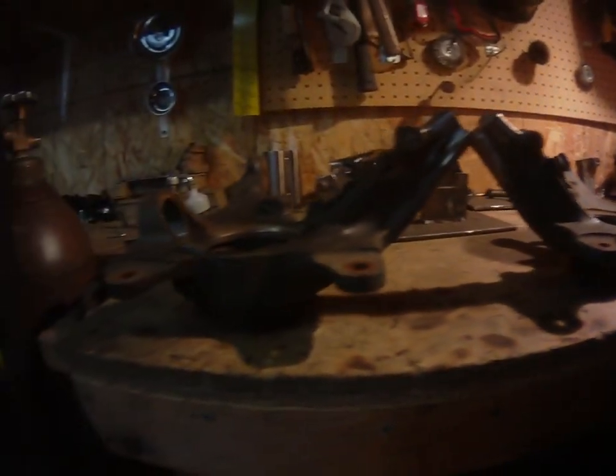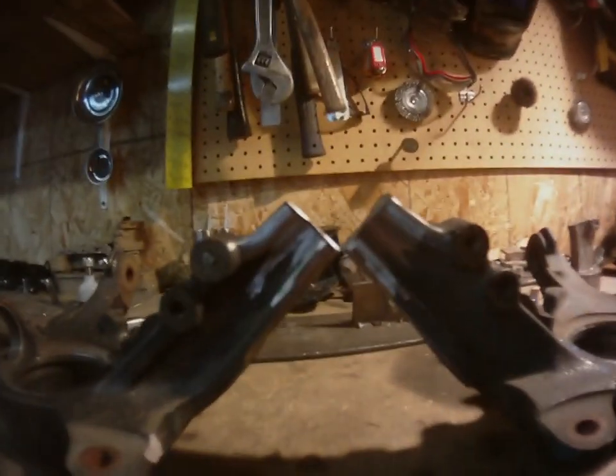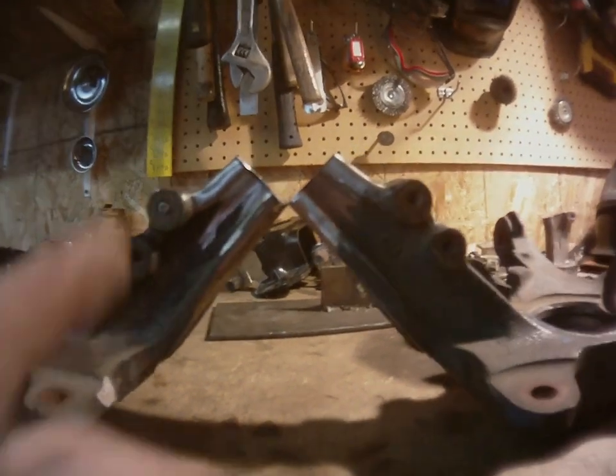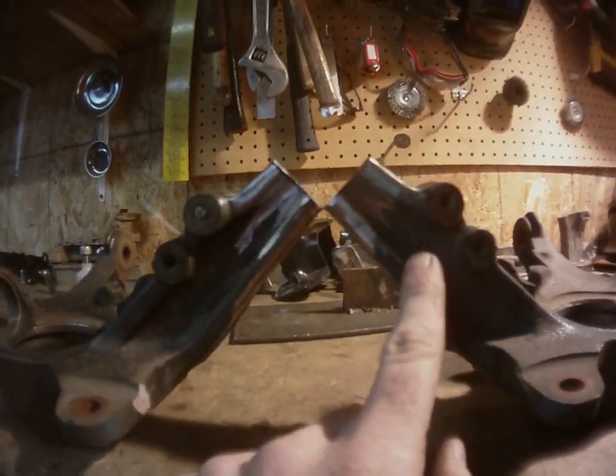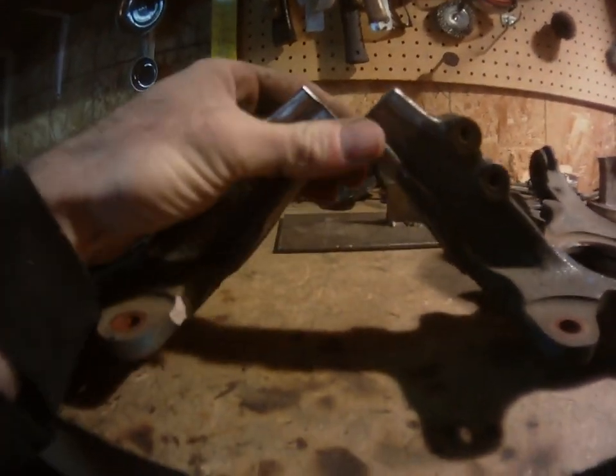These bad boys chopped up. Alright, spindles are chopped. Next step is an evenness check. So hub's flat on the table as per usual, and see, the angle of them is pretty damn close. This side looks slightly taller, but that's okay because we still need to grind and flatten these out anyway. So yeah, we'll just do that and then do a recheck.